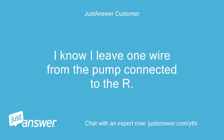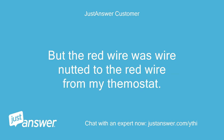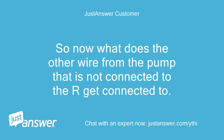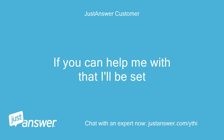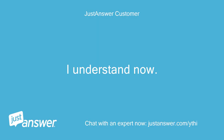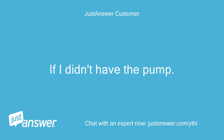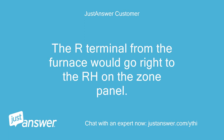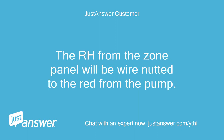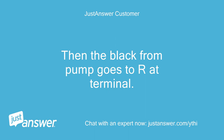I know I leave one wire from the pump connected to R. But the red wire was wire-nutted to the red wire from my thermostat — I can't keep it there because now the thermostat wire is connected to the zone panel. So now what does the other wire from the pump that is not connected to R get connected to? You are confused about those circuits — wire it using the wire nut to red from the zone and black to black just as you had it, no changes. I understand now. If I didn't have the pump, the R terminal from the furnace would go right to RH on the zone panel. But because I have the pump, the RH from the zone panel will be wire-nutted to the red from the pump, then the black from the pump goes to the R terminal. Correct.